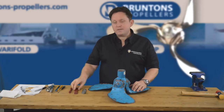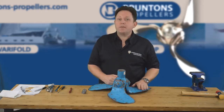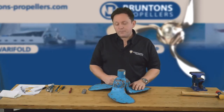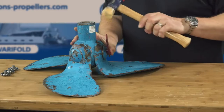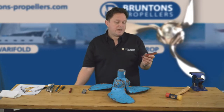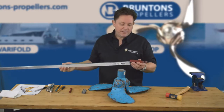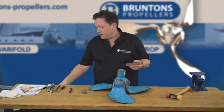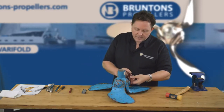Anyway, I've been successful using the peg spanner. One of the take-homes I've had was the most important thing is to be able to grip the blades — what I did was use some soft jaws on the vise, wrapped leather around the blade so it didn't mark it. We tried to break the seals with just a hammer, tap tap tap, that didn't quite work. So what I actually ended up using was just taking this little wrench that Brunton supply and sticking it in a huge long piece of pipe. From this I was able to get enough torque on the wrench — not applying too much force — and it just gently broke, and once it broke it's very easy just to wind them off.